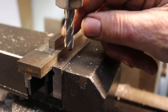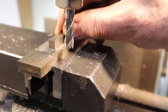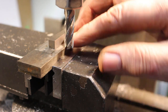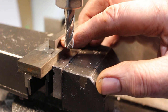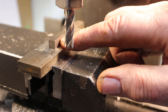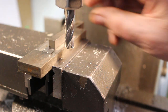So as we were machining at a full depth of cut, we're actually also reducing the surface area of the glue holding it in place. So what I thought I would do to continue is actually raise the cut to 4mm or 5/32. So we're only taking half the depth of cut, but also as we machine it away, we're not reducing the surface area of the glue, and see how far we get on. Again, we'll take 0.25mm or 10 thou cuts. First we need to just clean it in.